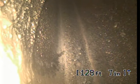Here we are 128 feet out. That's the city connection pulling back into 6-inch clay tile. As you can see there's roots there. You'll see why I wouldn't recommend jetting or running a larger blade here in a second — there's a decent size root growing horizontally down the pipe.